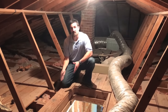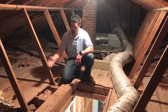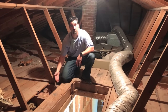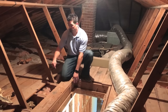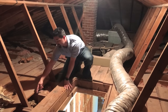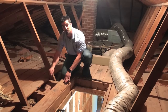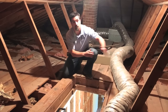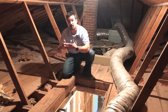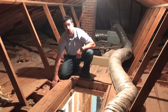So looking at this wall, is it a load-bearing wall or not? We can see that the roof is being braced down directly onto this wall — so yes, it is a load-bearing wall. It is also the case that these joists are spliced here. What I mean by spliced is that they're cut and actually bearing on top of this wall. It's not like the ceiling joist goes from one end of the house all the way across — they actually have to splice them and bear them on the wall. So this one is load-bearing.